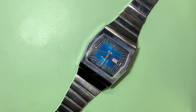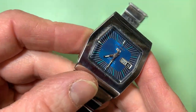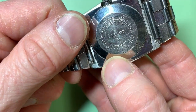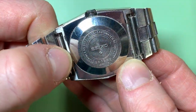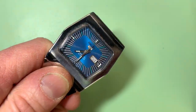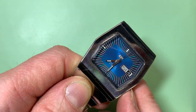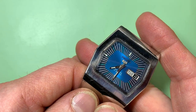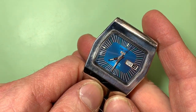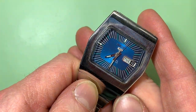Here we are on the bench and you can see the retro watch in all its full glory. They really did know how to do things back in the 70s. It is in pretty good condition overall. The serial number beginning with a three signifies it's a 1973. The second hand is just up near the 12, and if I just give that a little shake it's moved about a second. If it was a nice clean, well serviced movement, a little shake like that would give you a couple of minutes of power. So clearly there is something not quite right in here — I'm just suspecting old dirt and grime, but let's go in and find out.